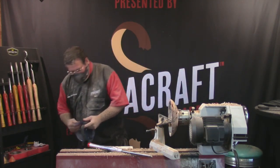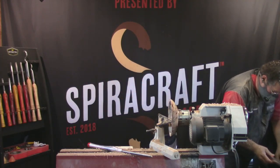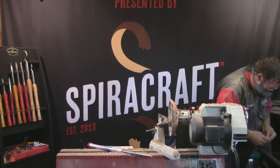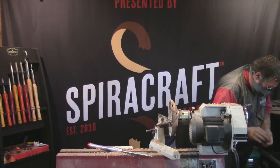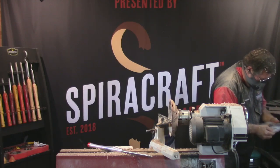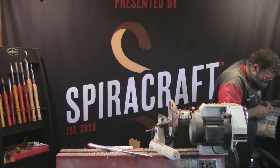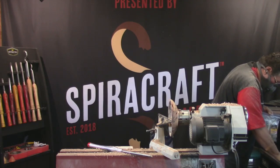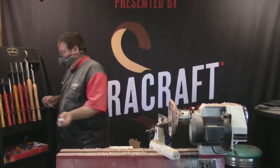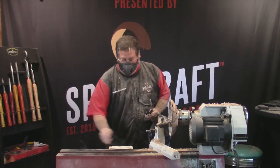And while I'm stopped here for a moment, let me look over here and see if I happen to have a wrench handy. I do. I'm going to put on a fresh cutter over here, if I have what I'm looking for. There's what I want. I'm going to change out to a fresh CI3 carbide to make sure we have the sharpest thing going.